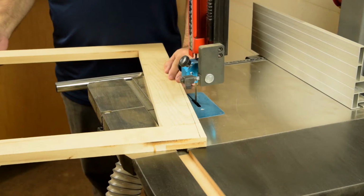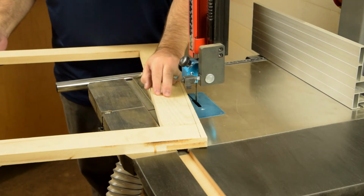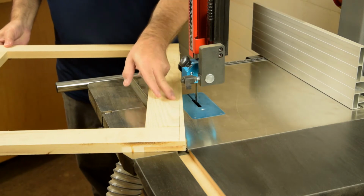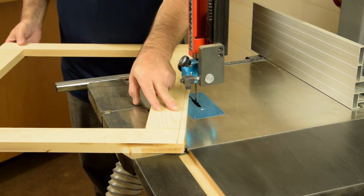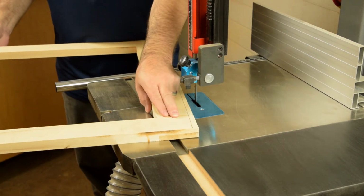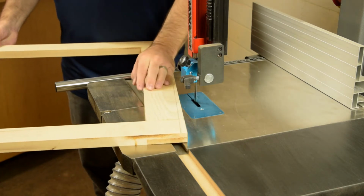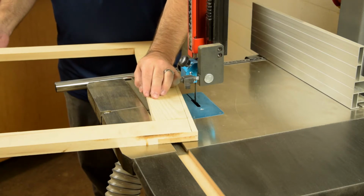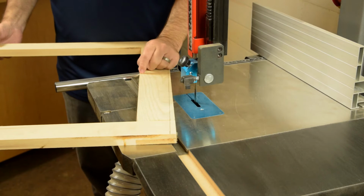So the hardwood frame has come out of the clamps. Our half laps are all dried and ready to go. We've struck a line here indicating the taper that the seat frame needs to have to fit in the chair opening. And it's just a lot easier to do it this way, build square joinery and then cut the angle after the glue dries. And there's really no benefit to trying to create angled joinery for seat frames. Just build them square and cut the angle after the fact.